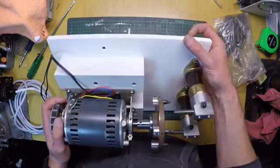Basically the way it works is that your tank capacitor has to fire when your electrodes are completely lined up and when they close the circuit. Current goes from this electrode, jumps the gap, goes through this brass plate, and jumps on this electrode which closes the circuit. The tank capacitor has to be discharged at its maximum charge, and at the same time these electrodes have to be lined up in the correct position. This adjustment here will actually enable you to time it correctly so you'll get longer sparks.